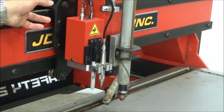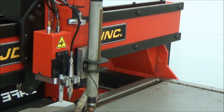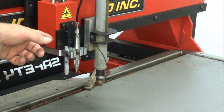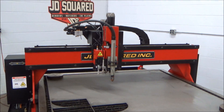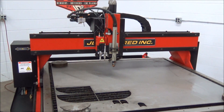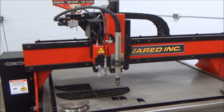We're selling machines to artists doing very intricate work because of the accuracy. They want to make little thin things, engrave, and stuff like that. The marker is there because you may want to cut parts out and put a part number on it but not mark the actual part itself — so we did both. This is slow speed, see the head moving slow? This is intermediate speed — that's 675 inches a minute, which is 175 inches a minute faster than the $28,000 competitor. Their top speed is 500. This is full speed — 1,150 inches a minute.